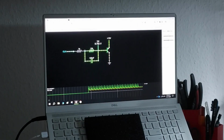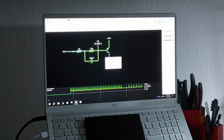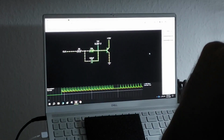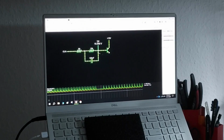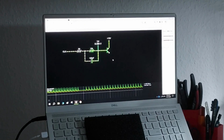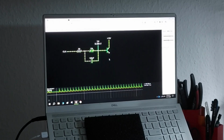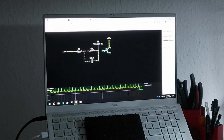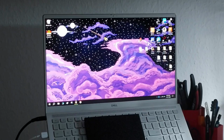No difference in this case. Let's see, 50 ohm output. It's kind of acting like a charge pump, which is interesting. Is that how it's inverting? No, it's just the capacitance on the base is so large. I think that's the cause of the initial spike to the positive. Yes, exactly. Just put more load on it. I just find this level shifting part crazy, because you have both a positive and negative level shift by the supply voltage.